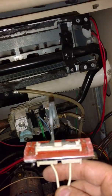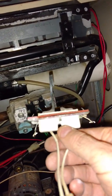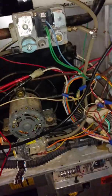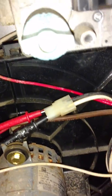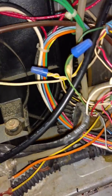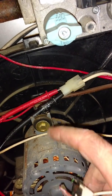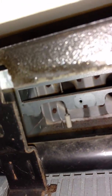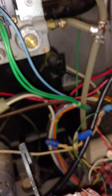I unplugged this little hot surface igniter — you can see it's in pieces right now. And of course it was infinite ohms, so no current would be flowing through there. On the other side of this plug I got the voltmeter probe stuck in there. When I held this down, of course with the power and gas on, it did several minutes of fans blowing, and indeed at some point it put about 120 volts there for about 30 seconds or so. There's this thing that detects if a flame is happening back there — that little rod sticking up. No flame happened, because this did not glow orange. I could see no oranginess glowing in that thing.